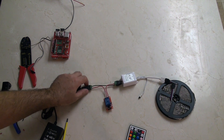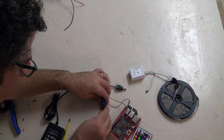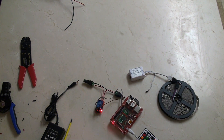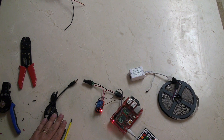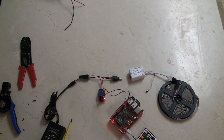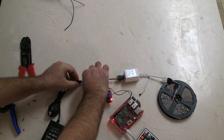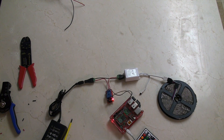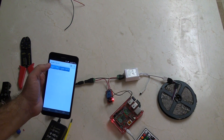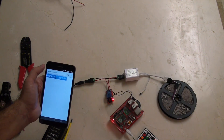I'll just plug that into the Raspberry Pi and control the light using it. Now as the Raspberry Pi is firing up, just a reminder — this is a 12-volt system, do not play with mains. It's time to connect here. We're in our normally-off state. I'll grab my mobile phone — light on. And there are the LEDs lighting up. Light off. And it's off. Cool, just one more time — light on.